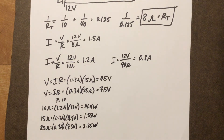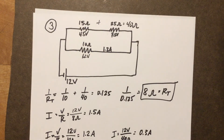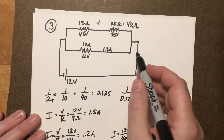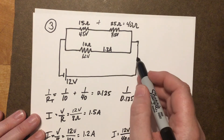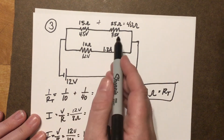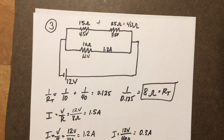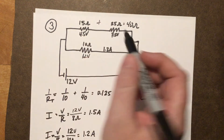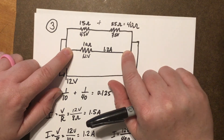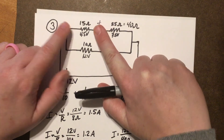The part about circuit 3 that's different is that instead of having a resistor that uses up some voltage before the parallel section, we have only a parallel path. But on one part of that parallel path there are two separate resistors, so while the voltage drop from end to end is the same along both paths, some of it drops at one resistor and some at the other.